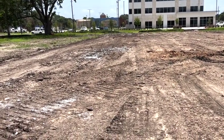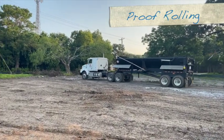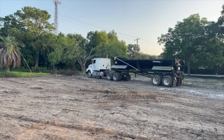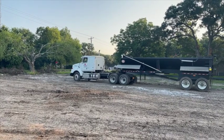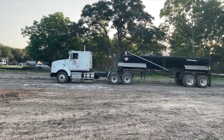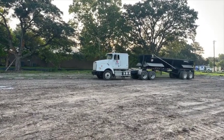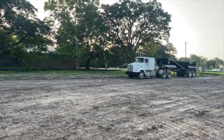We're set up to proof roll on Tuesday. Here we are proof rolling over it. You want 120 to 150 pounds per square inch of pressure when you roll it, so normally you just throw some dirt in the back of the dump truck and go. You roll back and forth. If you see anywhere where the ground starts going up and down and pumping as you're running back and forth, that's a problem — you can't have that up under your slab. So you have to stop and fix it and lime it. The inspector from the laboratory has to see this process done before they'll sign off on it. It's called proof rolling. Works real well, not too complicated to do — just got to have a truck full of dirt.